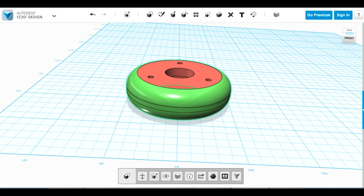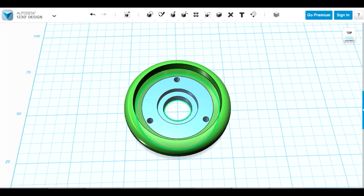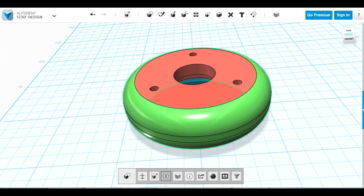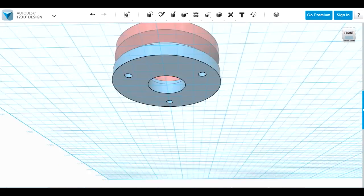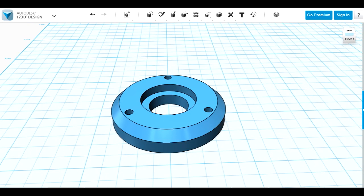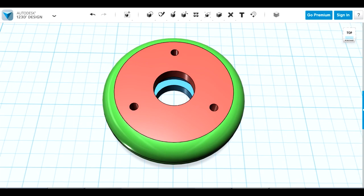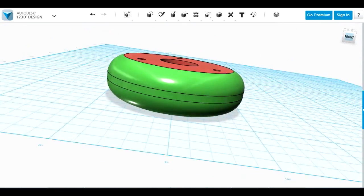My plan is to build a wheel which rides on a single bearing, riding on a single piece of studding bolted to the bearing in the wheel. The tire is going to be Ninjaflex, printed on the Lulzbot Mini Flexistruder, and the bearing is going to fit in a recess, clamped between two bits of plastic. Those two rigid pieces will be printed separately, screwed together, and they essentially encapsulate that bearing. There's space either side to get a nut in on some 6mm studding — it's a 6mm internal diameter bearing — so that one piece of studding or bolt with two nuts can hold that wheel nice and stiff.